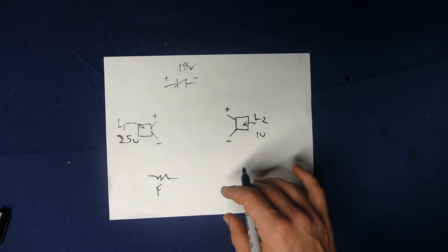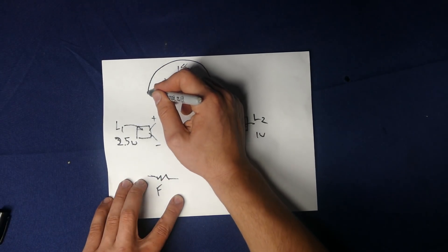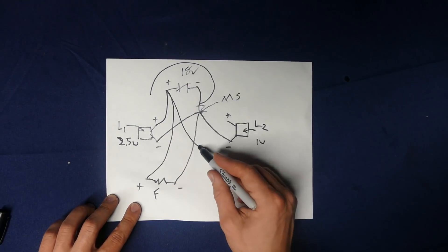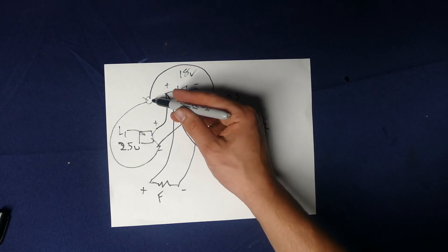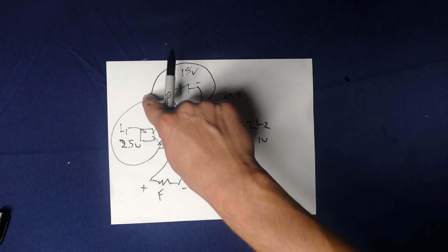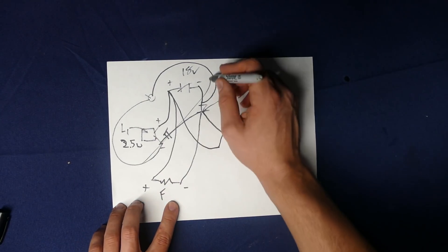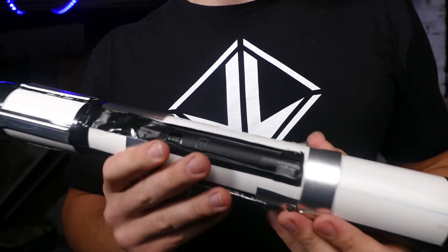Down here we've got a fan, and we have to add in these switches as well. Coming off of the negative, we have two wires — one that will connect to all of these and one that branches off over to here. So then we've got our main switch right here. This negative goes to all of these negatives, and this positive goes to all the positives. To activate this one laser, we have a button switch right here. Right now we have two switches — we have the main one and the button one. Ideally, the main one activates everything — the fan and the two lasers — but the button switch only activates this one laser. But right now if we press this button, it'll activate everything because the negative just goes right back to this negative. So what we need to do is include another sliding switch right here. When this one is in the off position, we only have this circuit. And when this one is in the on position, it allows both buttons to control the whole circuit.